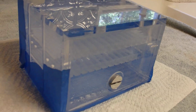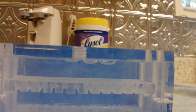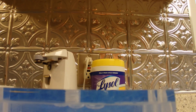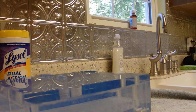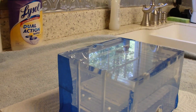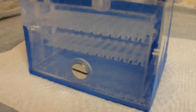a water feature. And the design of this particular waterfall I call the entrainment wall, because it has little slots milled into it. And those slots create surface tension when the water contacts it, and the water is literally entrained or sucked into those grooves. So it doesn't have any splashing, it's not making a lot of noise, and it's not picking up a lot of air bubbles. It flows right down those little grooves into a pond, and then it comes out the back.